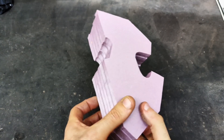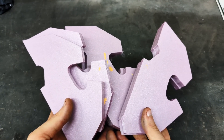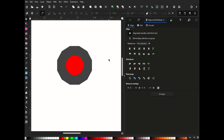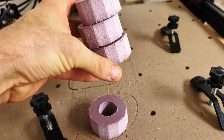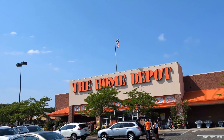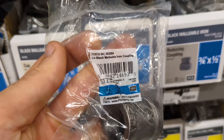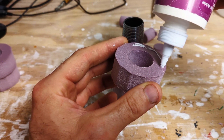What I have here is six fins that we need to fasten to the center. I made a twelve-sided polygon with a three quarter inch circle aligned in the center. Each side of this polygon is half inch. I then brought the file over to my CNC router and carved out four of these twelve-sided polygons — these are all one inch thick. Now I need to align them, so I went to Home Depot and purchased a three quarter inch steel nipple, four and a half inches long, as well as a three quarter inch coupling. The steel nipple makes it a lot easier to align and glue everything together and make sure it's straight.